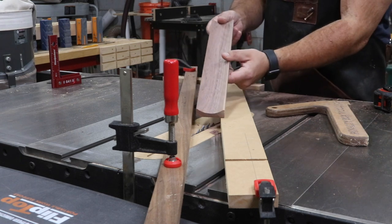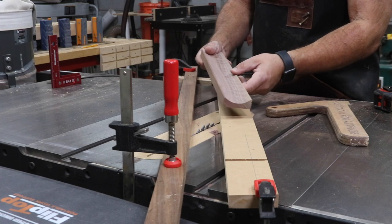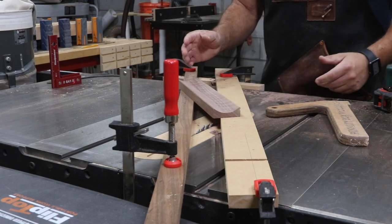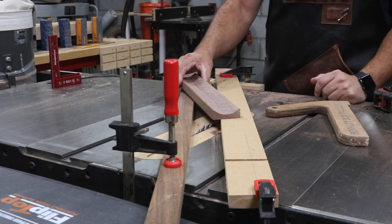And with that, it's done. You've got a really nice three eighths inch cove — really no major saw marks. A little bit of hand sanding and that is perfect. That can be used on wider pieces like I made for the box, or on trim pieces.